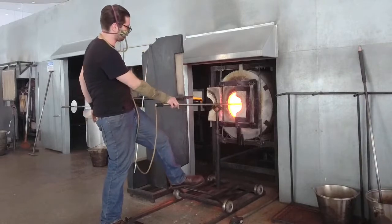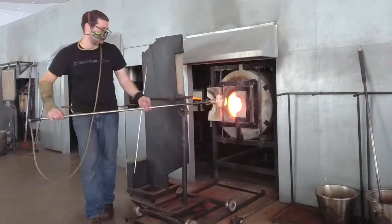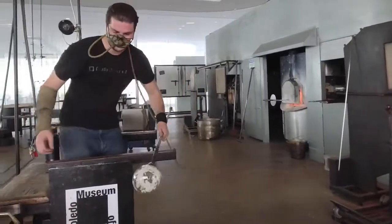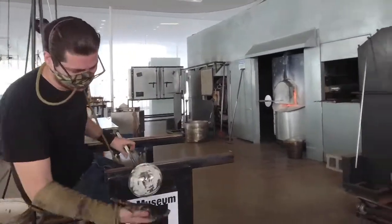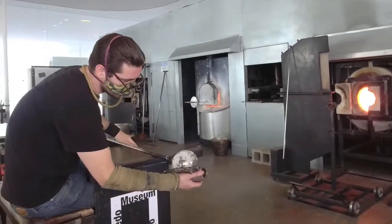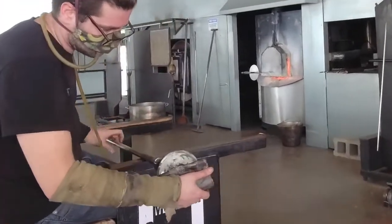We're going to make it a little bit bigger. Misha's going to stretch this neck out a little bit, because the tough thing about welding George's electrode on is that we have to make sure that the diameter can fit nicely. If at any point it doesn't fuse completely, the gas will start to leak out, and then we can't fill it with light.